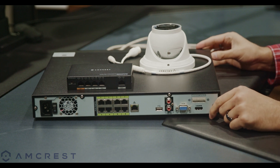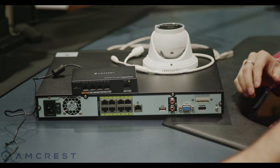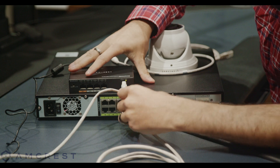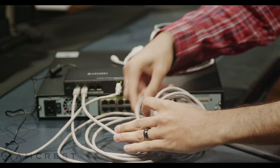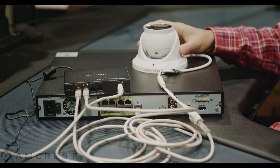If you're using an external PoE switch, here's how to do it. First ensure the PoE switch is connected to power and connected to your main network using an Ethernet cable — the main network cable will go into the uplink port on the switch. Once done, connect an Ethernet cable from the Ethernet port on the back of the NVR to an available port on the switch. Connect each PoE camera to the switch, ensuring the green and yellow LEDs are blinking — green indicates the device is receiving power and yellow means it's getting internet activity. Once cameras are connected, nothing will yet appear on the NVR, so you'll need to locate the cameras on the network and add them through the camera registration menu.